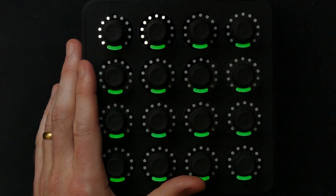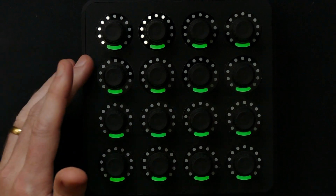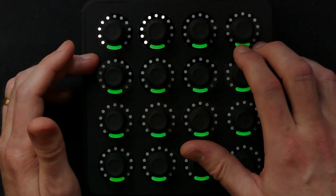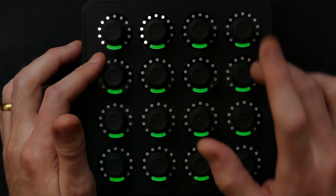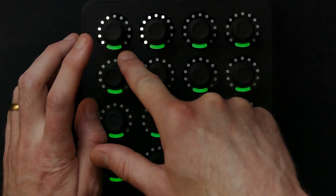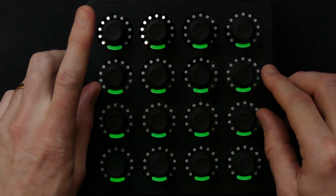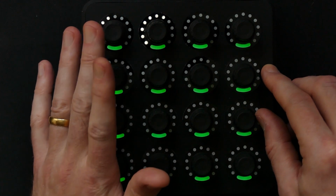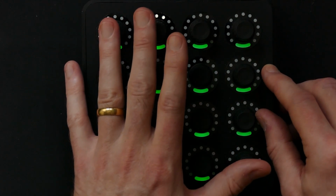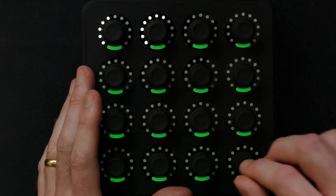Of course that is channel, yes, and of course another thing about that, so all the color messages and for setting the values and the animation externally, they use the CC values that are the default for the Fighter Twister. So that means that in order to set the value of this knob here, whether it's the animation or the color from another piece of equipment, you have to use CC0, which is a default for the first knob on the first page. And so 0 to 15 you would use to control the lights animation effects and get a visual feedback from another piece of equipment to the MIDI Fighter Twister.